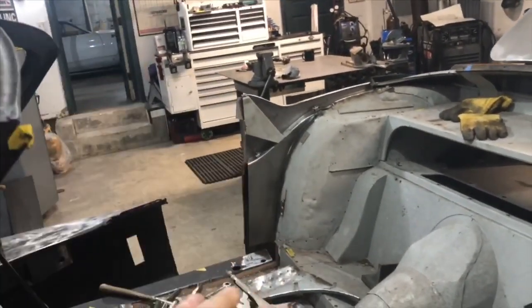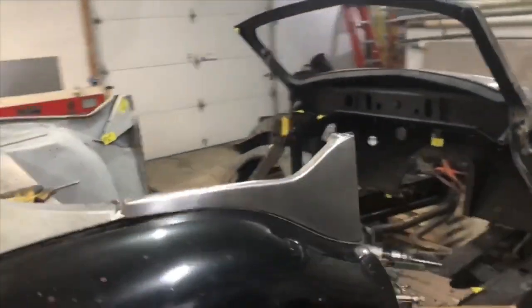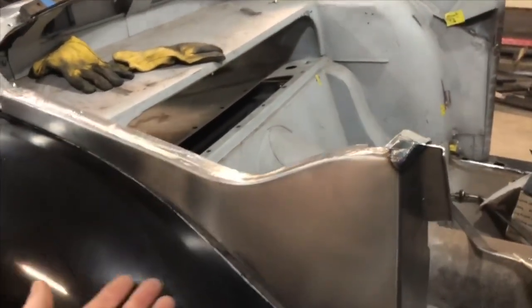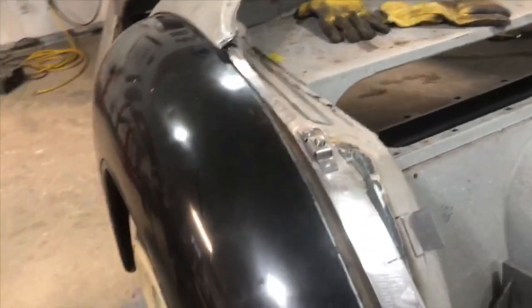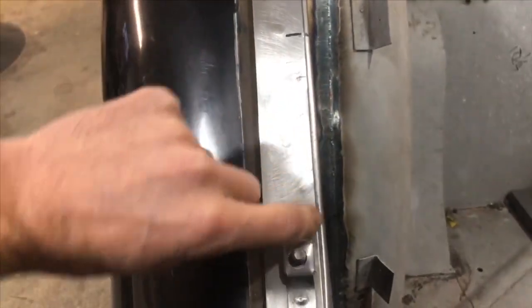This is what I worked on today and I got it to fit pretty nice. You can see it better on this side — I added material in, and the whole piece came out of one piece of metal. I bent a 90 back towards me, a three-quarter inch, then the top I bent an inch and a quarter edge, and then I put another strip on top like factory had that was spot welded in to hold the cage nuts.